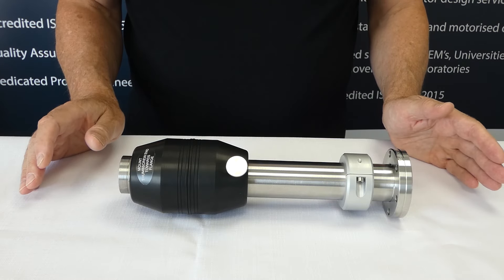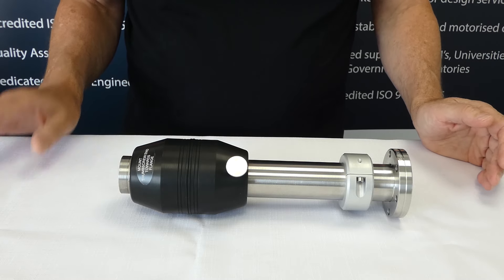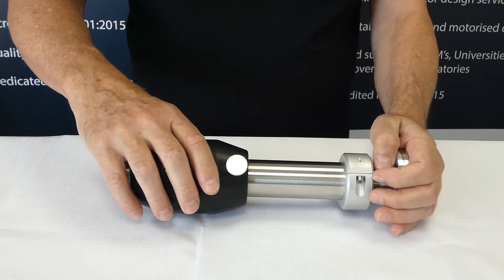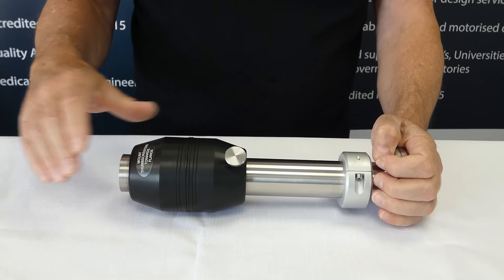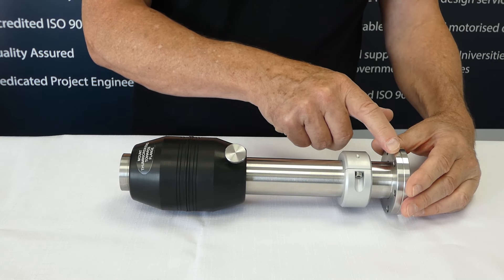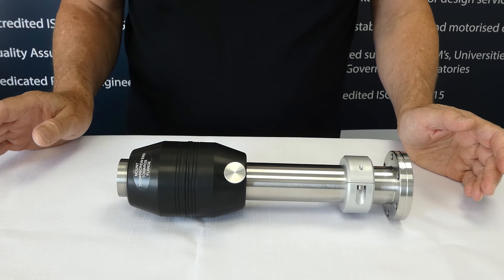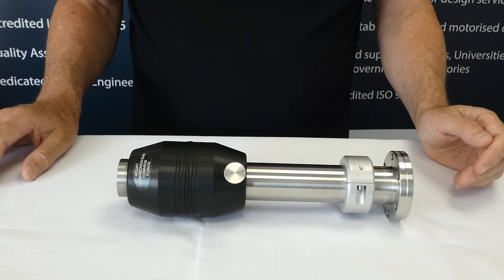Sometimes the item will decouple or you have got a poor magnet feel — it just doesn't feel right. The first thing you should always do is make sure the magnet housing is fitted this way round so that the thumb screw is facing the flange. If you fit it on the wrong way round then you only get one set of magnets connecting, which makes the device very weak.